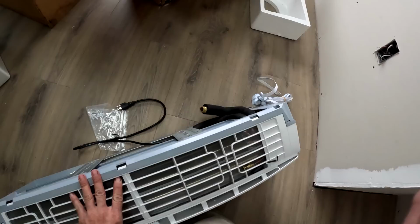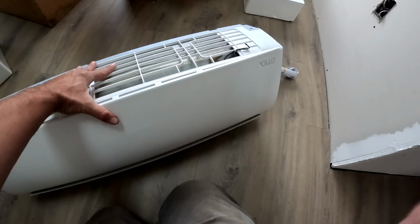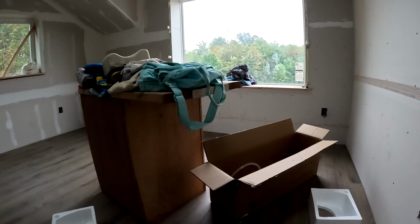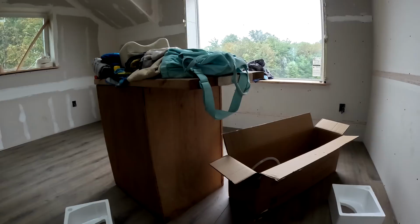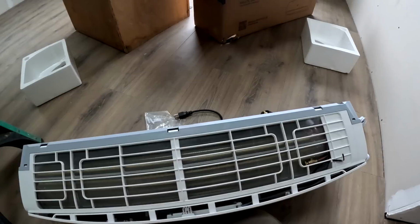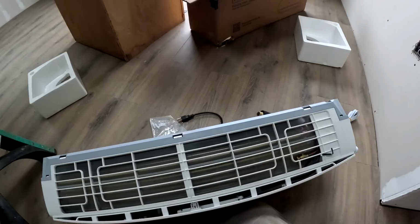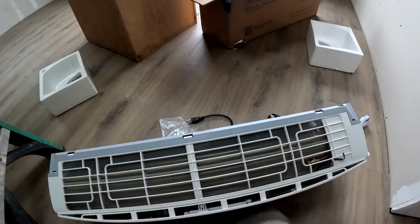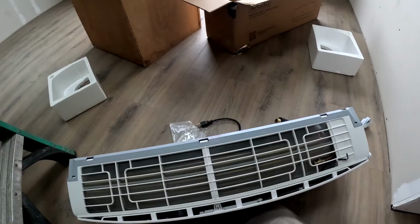They're for heating and cooling, but I have no use for the heat because I have the radiant heat in the floor. Now, I probably will hook these up so that they're run off of secondary heat. So in other words, if the thermostat is calling for heat and some time goes by and the temperature doesn't raise or it even lowers, then it'll kick the secondary heat on, which I can program it in to use the heat off of this for that. But the complicated part about that is that I'm probably only going to have 90 degree water running through for the radiant heat. And I could raise that up to 120, 130, 140 for the fan coils. And then I could use a mixing valve to get it back down for the radiant heat. But I'm not going to get involved in that.